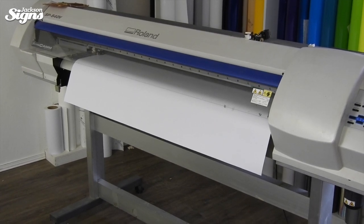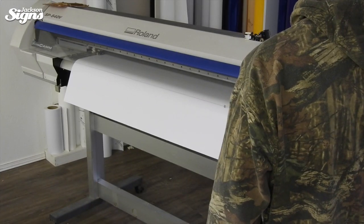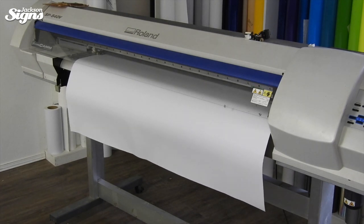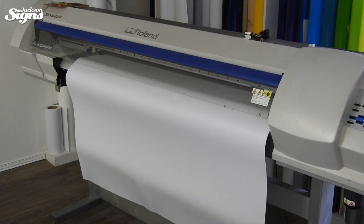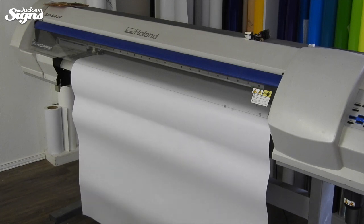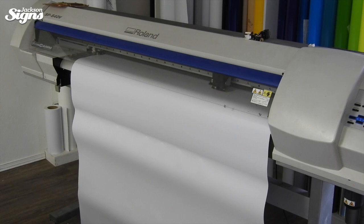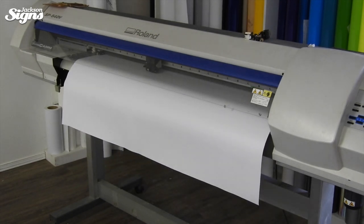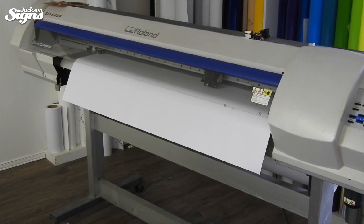What we're going to do now is use a plotter to cut the template for the sign blank. The plotter will start up in a second — it'll move around and cut a stencil so we can accurately put a cut line onto our substrate for trimming. We're adjusting the cut pressure because it's a little thicker material — just cheaper material since it'll be used for about 10 seconds and thrown away. The material got all kinked; it must have gotten cold in here last night.